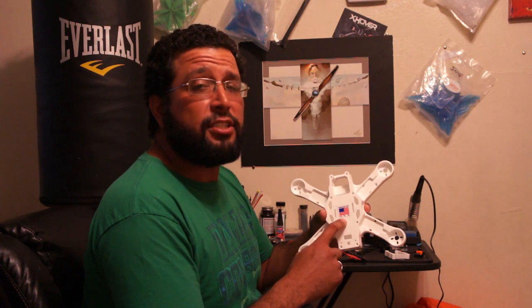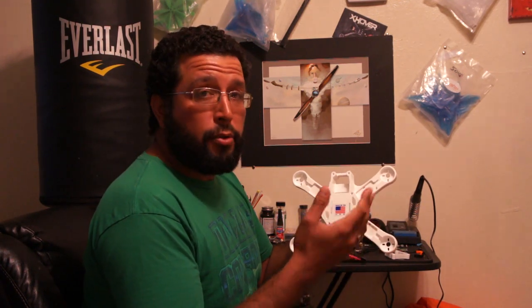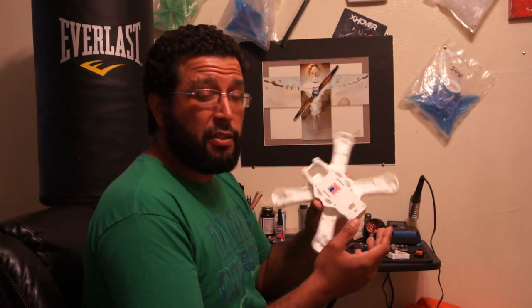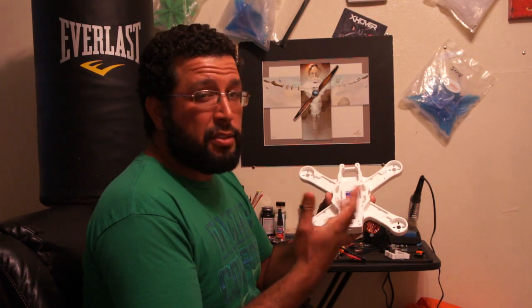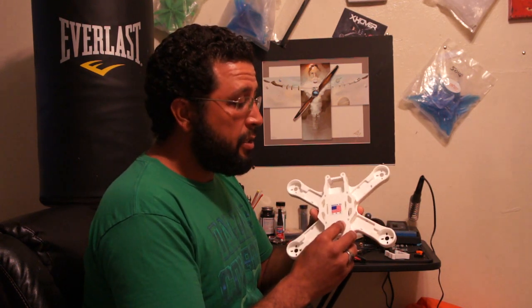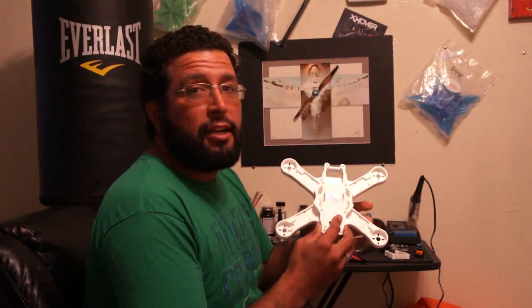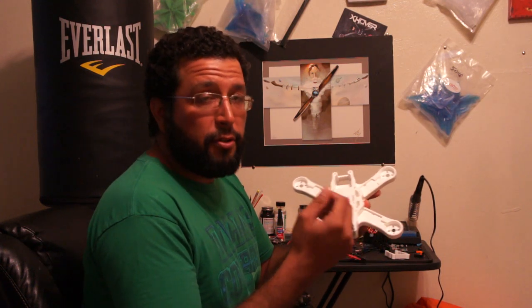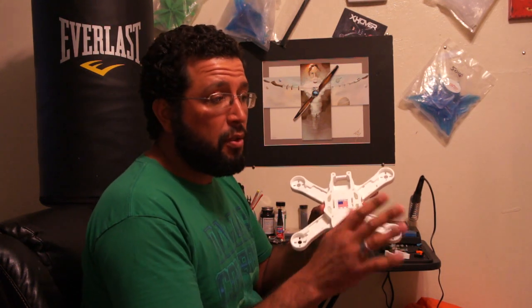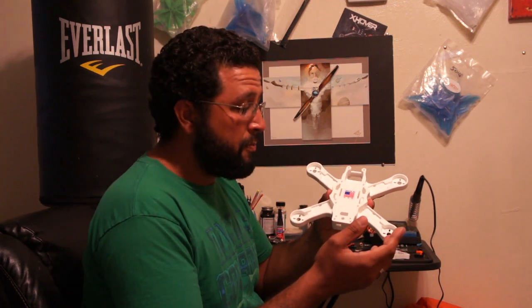This is made of HDPE plastic, high density polyethylene plastic. Pros to that, not that heavy. Actually, this is about 127 grams. It's a pretty heavy frame. Well, I fly freestyle, so it's not a big deal. Second, it does not conduct electricity. So if you have a wire that's got a burn in it when you're soldering and whatnot and it touches the frame, no problem. It won't short it out.